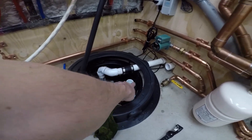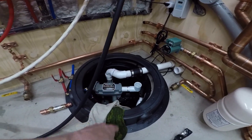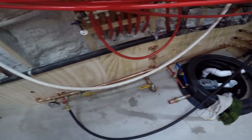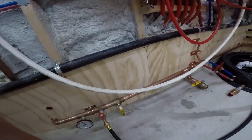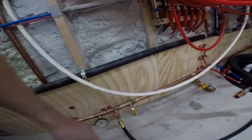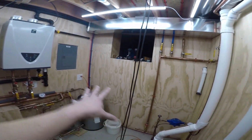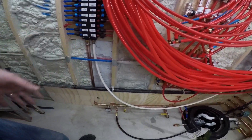Then I can open it up to drain the entire thing. It makes a Y, goes over here, makes another T down to a shutoff, and this is going to go through a dual check valve and into my water backup system for my sump pit. I just have to connect that PVC line and then I'll have my regular sump pump plus my water backup sump pump. I can always shut it off and isolate this section to drain the cold without affecting the hot water.